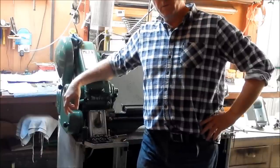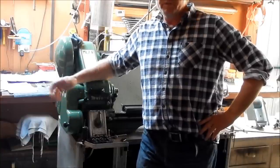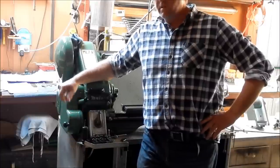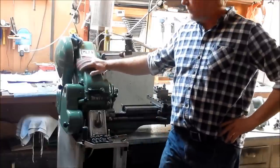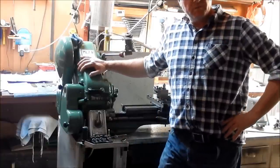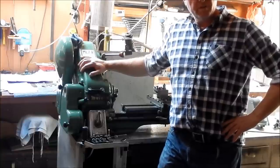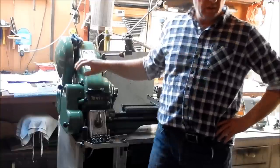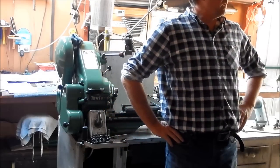John's going to put it together for us and we'll see how it looks, and maybe give some of you guys some ideas on how you can modify your lathe to do what John's done here. So, as I said, he's just got the 3.5 inch swing Myford, and I think we're talking, you can swing up to nearly 12 inches with this extender. Those flywheels you did, you had to take 2 inches off the top of those, didn't you? Yeah, I did. And I think they ended up about 9 inches at the end of them anyway. It's pretty close to it.